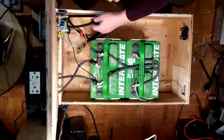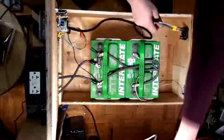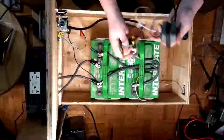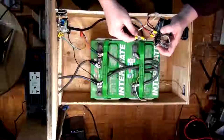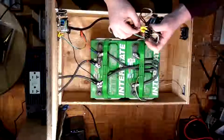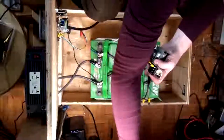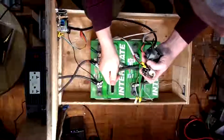Bloody hell. Okay, so this is the cable that we have that's going to be going to common on this relay because it's the output. So I'm just going to start by finishing off the mounting process of everything. So this is going on the common. The common is back here. Let's see here. We'll just keep things consistent. I need a heat shrink for these guys. That is critical for this application because low voltage and high voltage mixing is not a good thing.